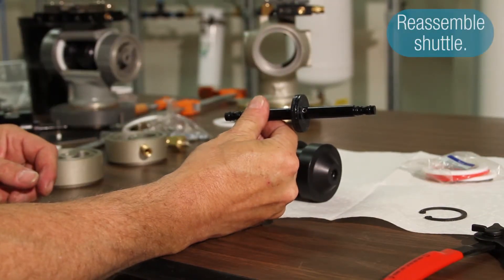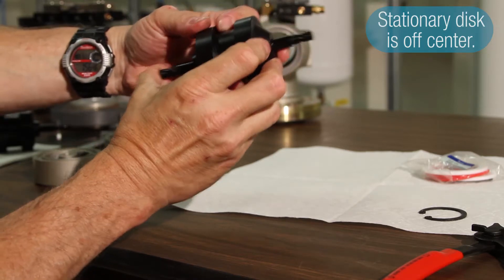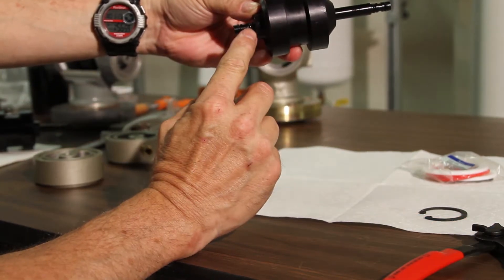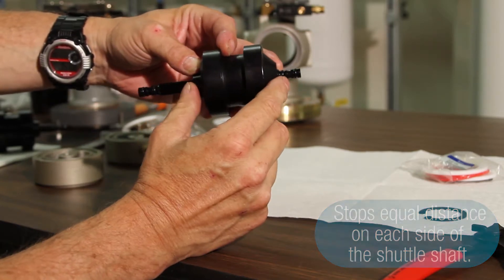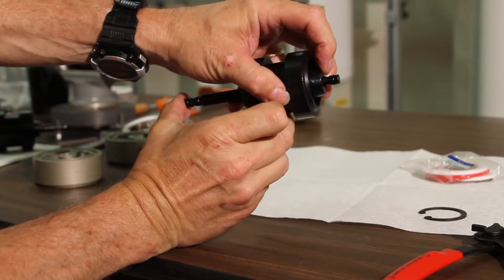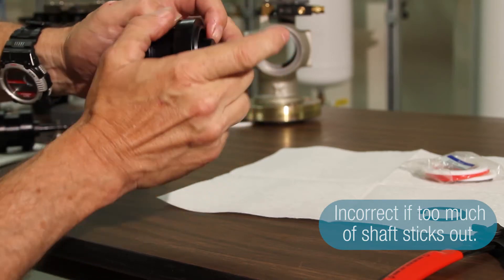On this particular size valve, it's critical to pay attention to the way the shuttle shaft goes back into the valve body, because it looks like the stationary disc is dead center of the shuttle, but it is actually not. After you rebuild the shuttle and put the shaft back in, throw the shuttle shaft both directions. If you've got it in correctly, you'll see that it stops about equal distance on either side of the shuttle shaft. If you put it in backwards, throwing the shuttle shaft one way drives part of the shaft inside the body of the valve, and throwing it the other direction leaves a lot of the shuttle shaft sticking outside the valve body — that's how to tell if you've got the shuttle shaft in backwards.